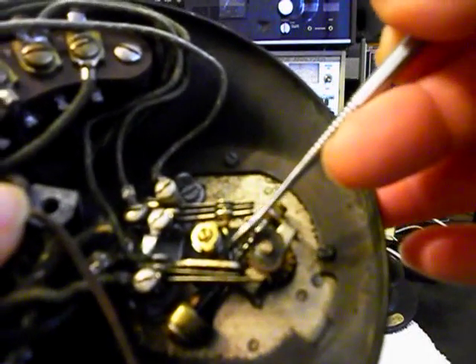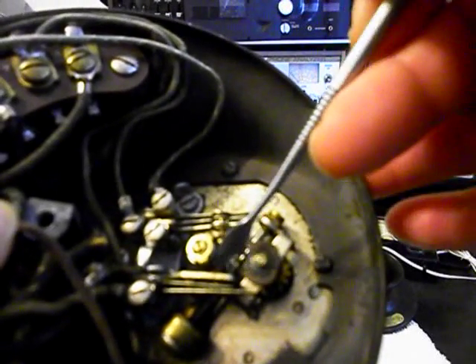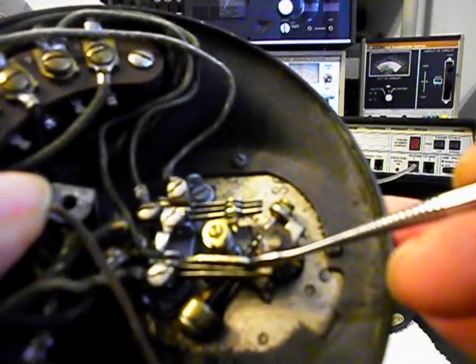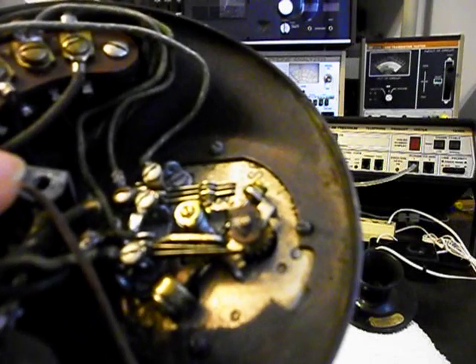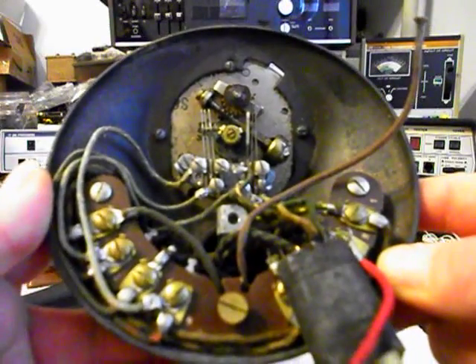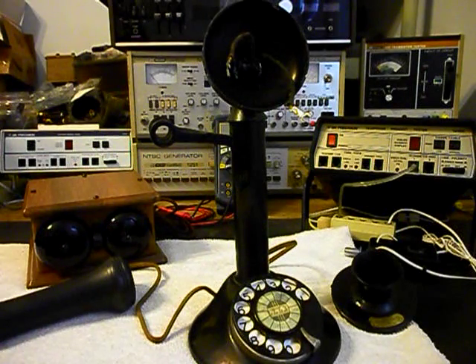There's also a piece of linkage on the center axle of the rotary that holds it together. It has a little prong on it that's supposed to sweep back on its finish cycle and grab these points to make sure they contact — and that's not working either. At some point someone tried to adjust it, got lost, and everything went awry from there. This gives you a look at the unit. We want to get a start on this, and we'll take a short break and come back with more video as we move forward in the repair and conversion.